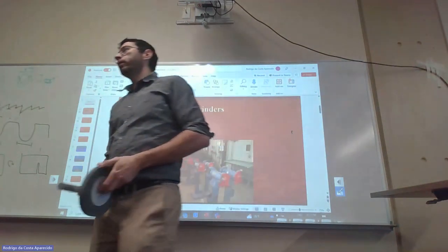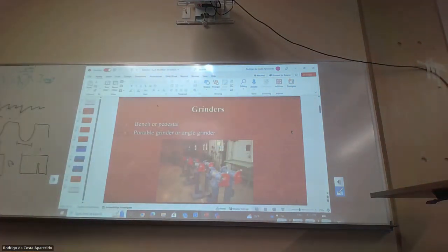So that's something that we call the ring test. If you hold the wheel and you tap it, it should make a ring sound. If there's a crack, it will give you a dull sound, like this, like thud, because the crack doesn't allow it to resonate. I can do the ring test if my wheel is in there, and I'm not going to take it apart.